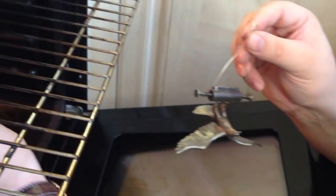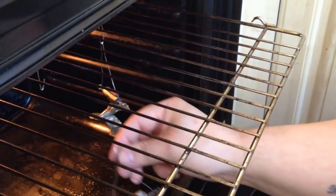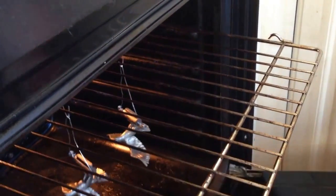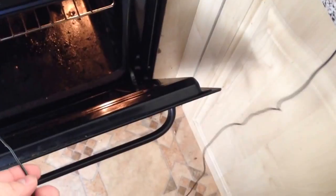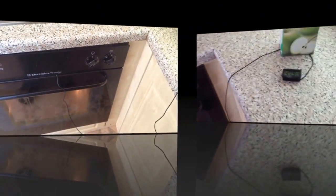We are now putting the eagles into the oven after spraying them with high grade conductive ink. You must set the oven temperature to about 50 degrees Celsius and leave the eagle in there for about 3 hours. It is very important to check the temperature with a thermometer and ensure the temperature does not go much over 50 degrees Celsius as the ink could crack. The best temperature will be between 43 and 50 degrees Celsius.